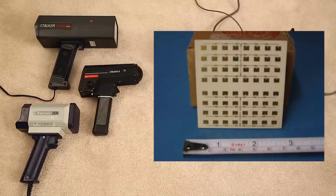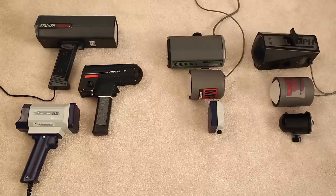The patch antennas on the Falcon HR create the experience of a larger antenna. Similar to the ATR, one set of patches transmits the signal and another set receives. Unlike the ATR, the range of these patch antenna units is not as good — not great at picking up signals at long distances. One key benefit is you get a very small, compact antenna. What you're losing in performance, you're gaining in compactness — so there's that trade-off.